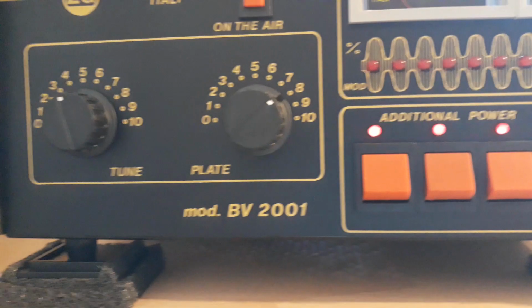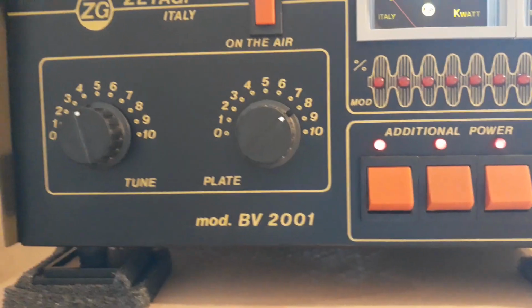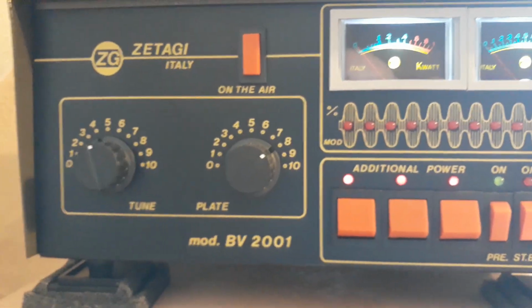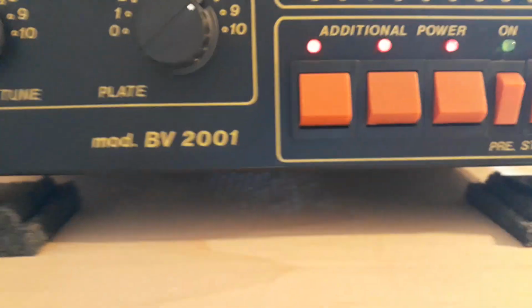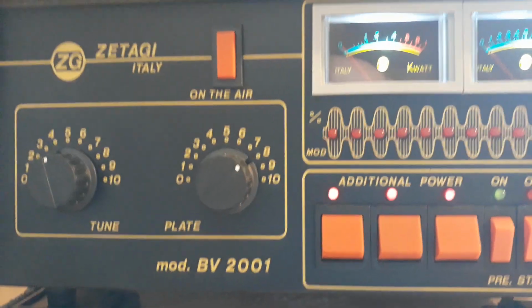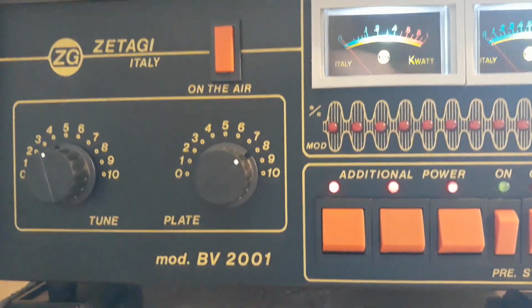Got a nice cooling fan in it to keep the tubes cool. The tubes, of course, are horizontally mounted, and therefore you can just see in there, tubes there, and the air is drawn up from underneath the amp and straight through around the tubes and out the vent in the top. So yeah, it works a treat at keeping it cool.